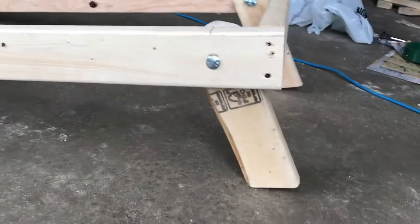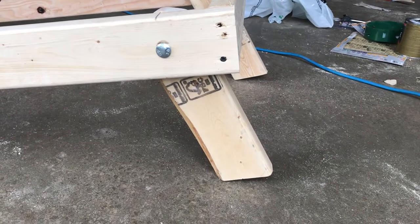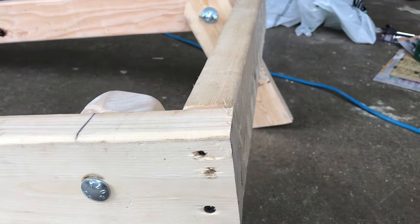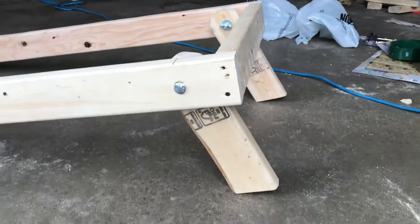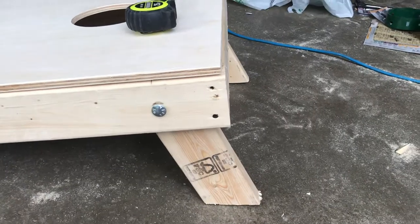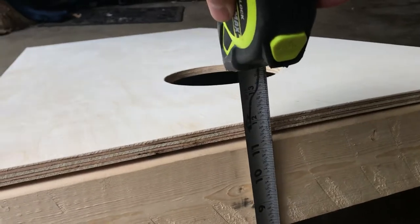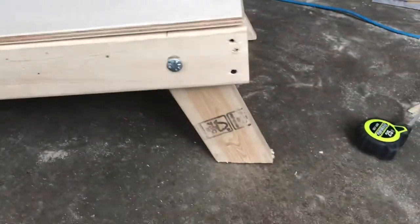We got it all set up — my angle is just a little sharp on the leg, so we're going to shallow those angles out. We're at 12 and a quarter inches, so shallowing that angle out should get us right down to 12 inches. We got our angles right, sitting fairly flush — we did it. We're at exactly 12 inches to the top of the deck. Perfect — got everything matched up, ready to throw beanbags.